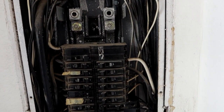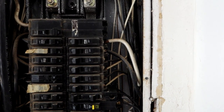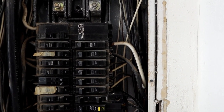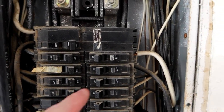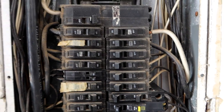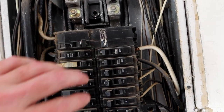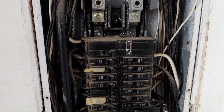I got the panel off, and I got to admit I'm not really sure what's going on here — it's a rat's nest in here. I do have a mixture of voltages, because there's 120V powering most of the house, but there are a couple places like right here and in the laundry room that have a 240V panel going into them. I suspect that's what this is here — the 240V line — and that's a big hefty 50-amp breaker. Most of the rest of these are 20 or 30 amps. There was supposedly something special with these breakers here, so I think I'm going to start by shutting off these five and see what happens.